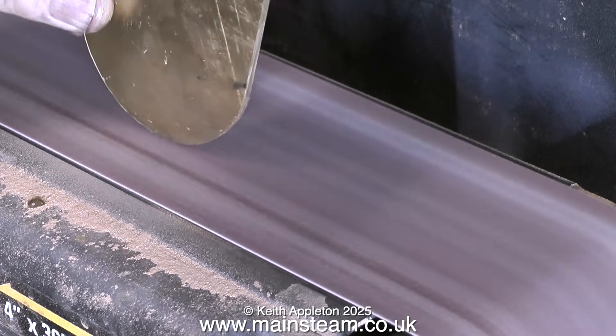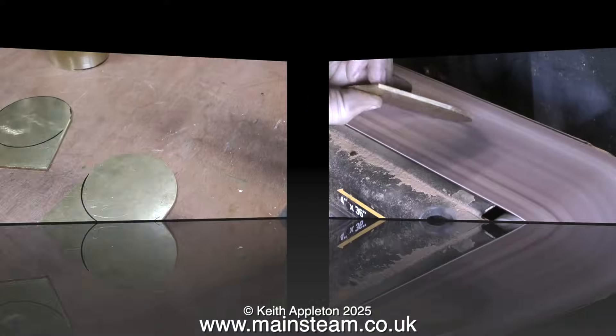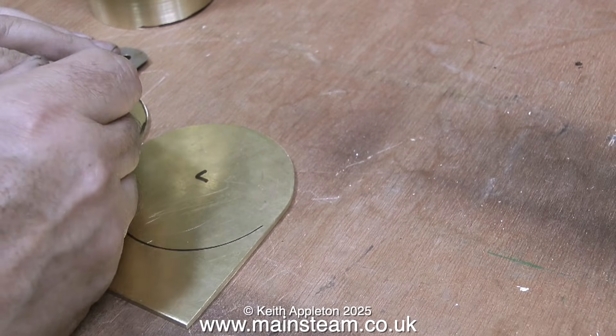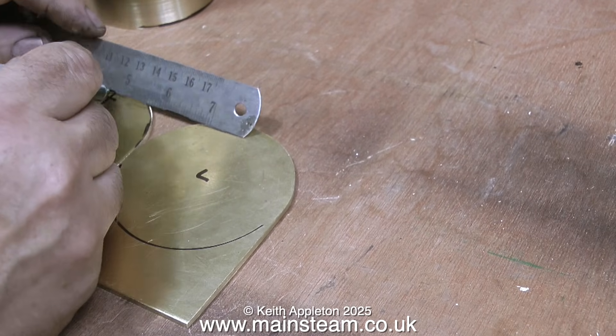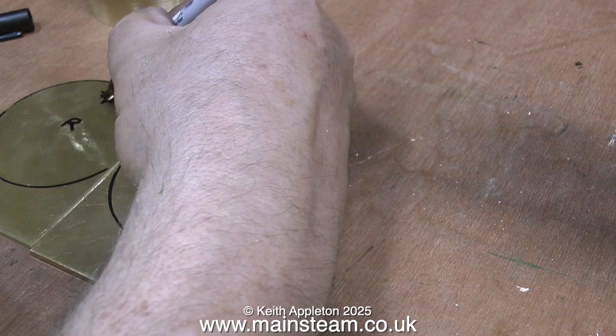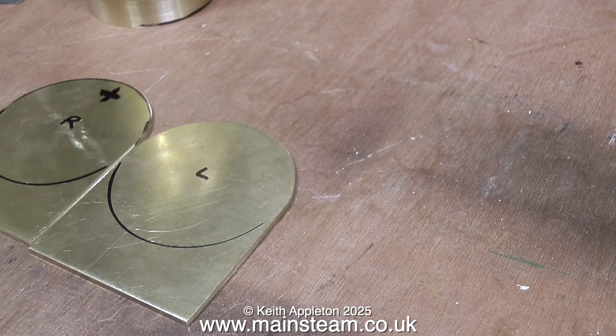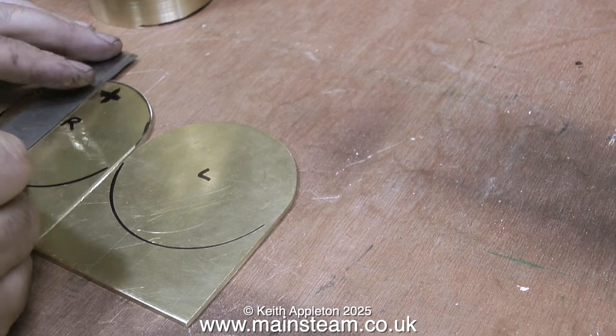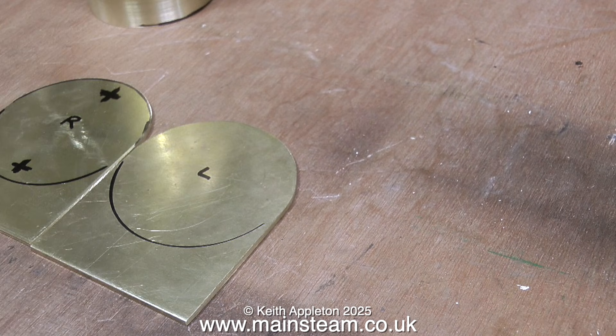As you can see, it's trimmed the edge of this piece of brass perfectly. To get a really smooth finish I'm going to move over to the belt on top of the belt sander, and in no time at all I have two very nicely shaped supporting plates for the condenser. After holding the tube in its approximate finished position and drawing around it with a felt tip pen, this gives me an approximate position where the tube is going to be soldered.